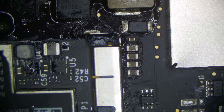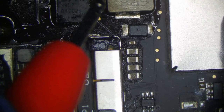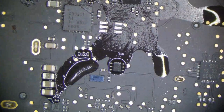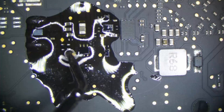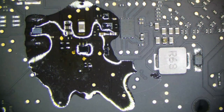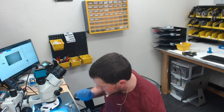All right, let me check this thing now. I'm off of pre-record, diode mode. Diode mode ground right here. 2.70. Diode mode ground here. It's good. All right, this board is really nasty, so it's time to clean it. Should I check, make sure it still spins the fan? Probably.